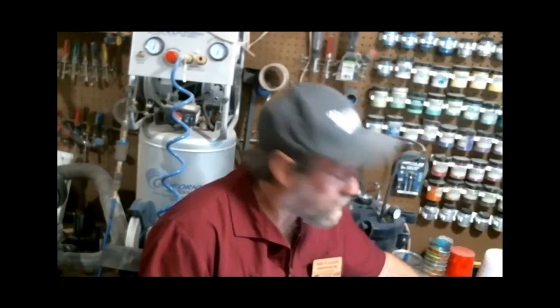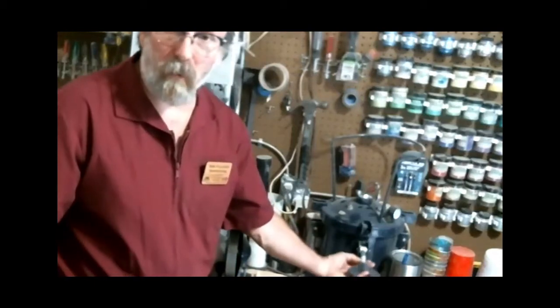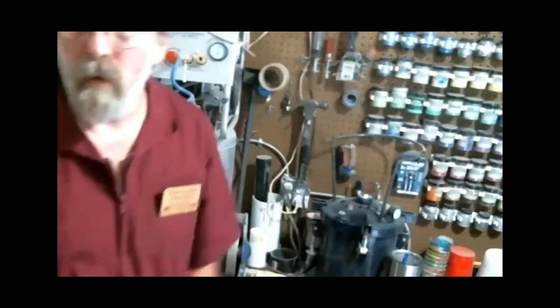Yes, I absolutely have blow-off valves on my pressure pot. That's a must-have for me, and I push it to what I'm comfortable with for that pot. Like I said, a Harbor Freight pot, I don't trust at all. They have very, very cheap 1/4 inch, basically, or 5/16 bolts that are Chinese steel. I don't really like them for the lid. On this pot, you see you have big 5/8 bolts that actually latch it down. I trust them a lot more.